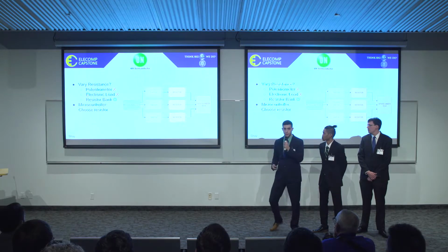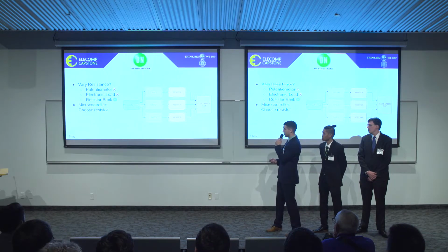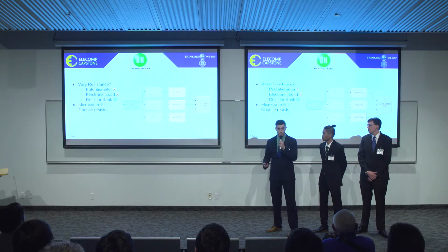So the way we actually test for thermal resistance is we apply a large amount of power for a micropulse duration. We then take our measurement and we repeat this process. As we repeat this process, we increase the time pulse, and in order to avoid damaging the FET, we need to apply a buffer or a resistor between the power applied and the device under test.